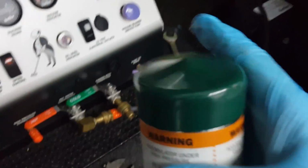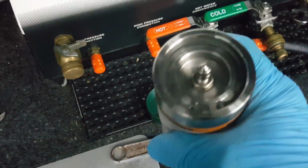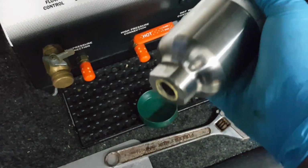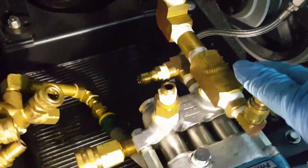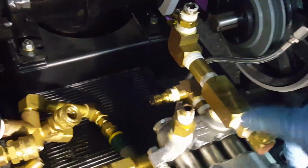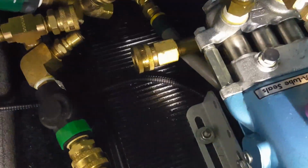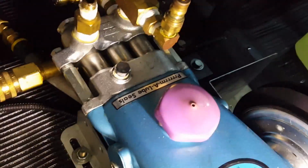That's all it is. This cap is just replaceable, goes on top here. Pop that a second so you can see. That's just where they kind of fill them up. Takes care of so the hoses don't pulsate like crazy. Let's set that off to the side. All right, so these here pieces, because I'm going to pull a cat pump, I'm going to just leave them on and reassemble them there. And so now I'm just going to pull these 4 bolts, or these nuts off this bolt, and this whole thing is now just going to pick right up out of there easy.